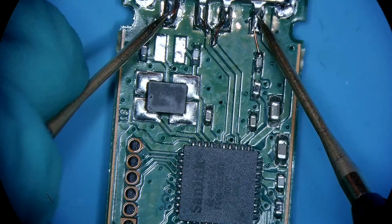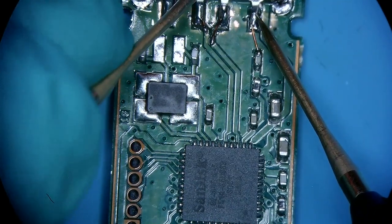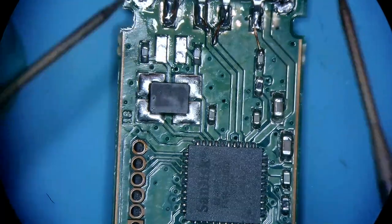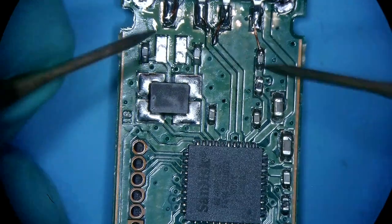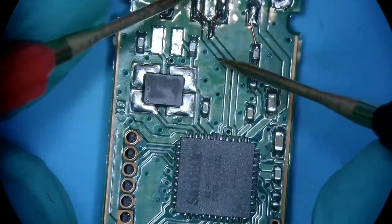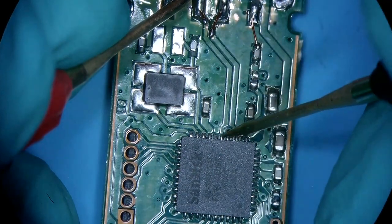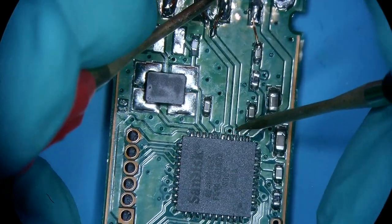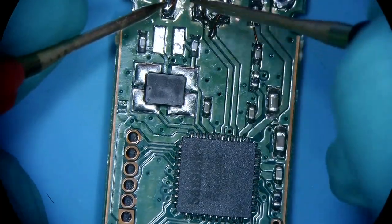Yeah, we're good. They're not linked. If they were, we would have heard this. If we're not hearing it, that means they're not connected. So now let's just check, make sure we got connection for the headers on data pins. So we got one big fat trace running here, linked. And a big fat trace running here. This is also linked. Our power is right there.